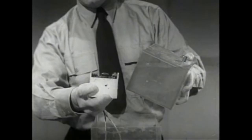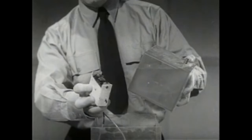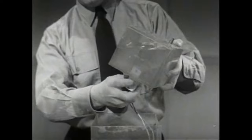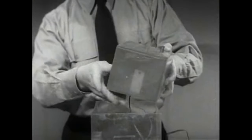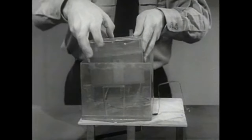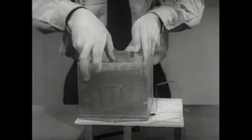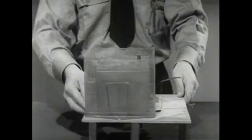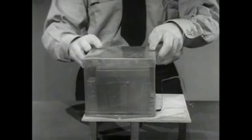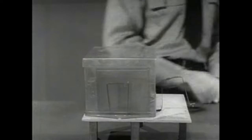The battery is encased in an insulated box made from clear plastic and placed in a calcium chloride solution that acts as a thermal mass. The clear plastic allows the battery to be warmed by solar radiation, similar to a greenhouse, and prevents it from freezing at high altitudes. The battery provides power to the electric igniters in the plugs.